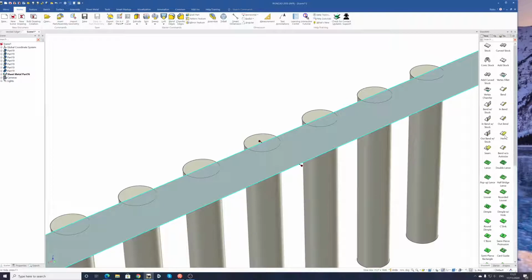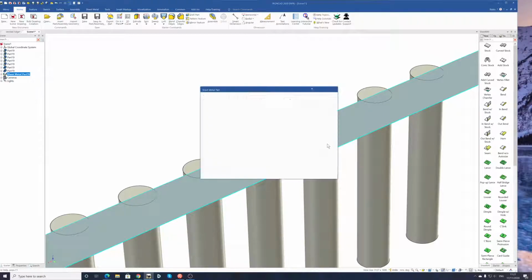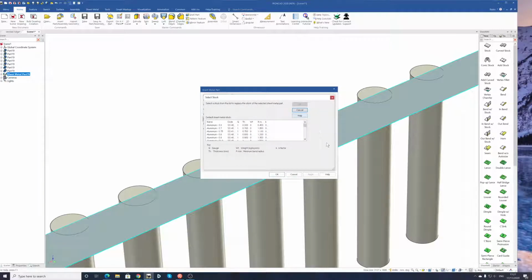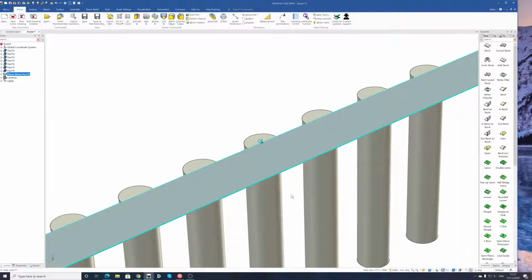It's counterintuitive, but when you think about it, you either have a cap fitting in or a cap fitting over, and that's what you're trying to do. One of the things I do notice on here is I haven't chosen the right stock. It's got the 0.3. Let's just change that, and you can edit this stock and put your own stock in. Now I don't want brass, let me go down to hot rolled 2mm. Let's say okay, put that one on, apply, done.